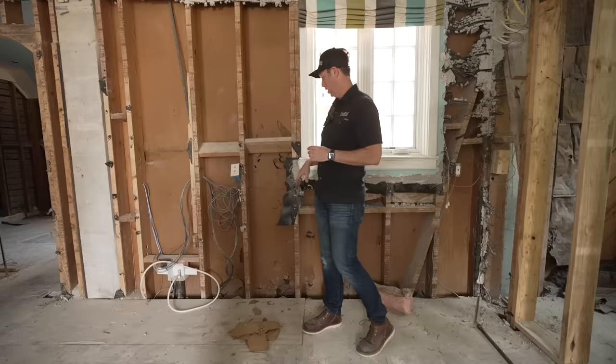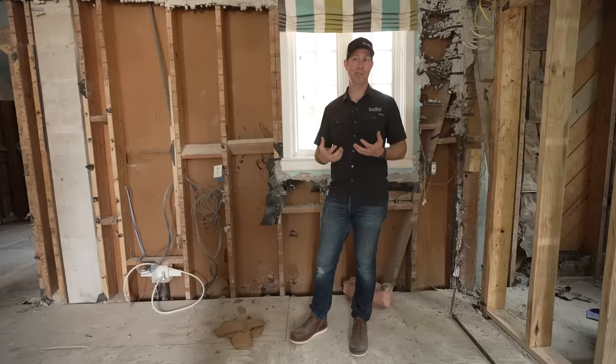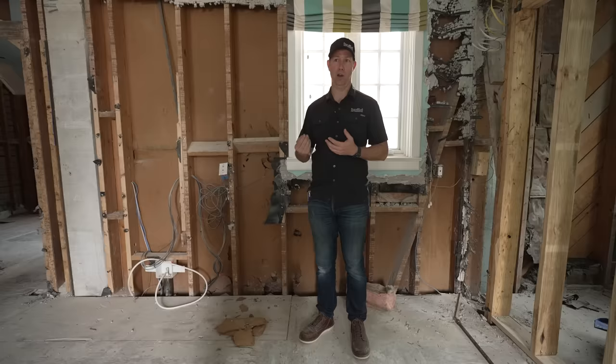There are holes in this sheathing — we could get airflow through here, and we're certainly going to get moisture and vapor. If we add insulation and then sheetrock, we could have some problems. Your client might come into this house in two or three years and notice a musty smell. We could have mold growing on the back of that paper facing on the sheetrock. This particle board would certainly start to break down if it wasn't able to dry easily. Let's talk briefly about why rot and mold happens.